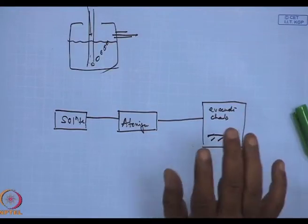So, tomorrow in the next class, I shall take off from this point where we have got CVD reactors for deposition of thin coatings and explore the different techniques, advantages, disadvantages of chemical vapor deposition. If I sum up today, what I have covered up to now is the thermal spray, looked at the HVOF, high velocity oxyfuel spray, looked at the detonation gun coating process, and are now on chemical vapor deposition techniques.